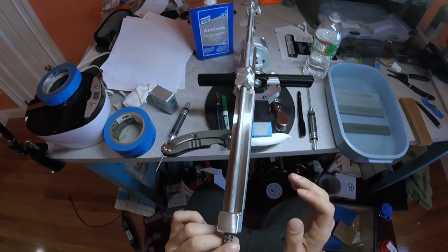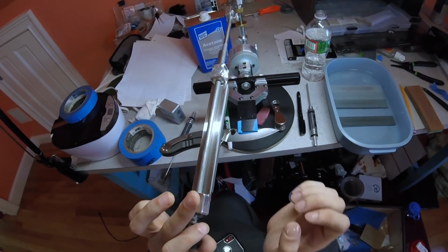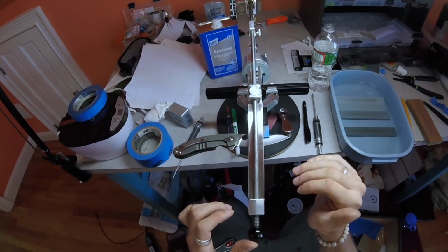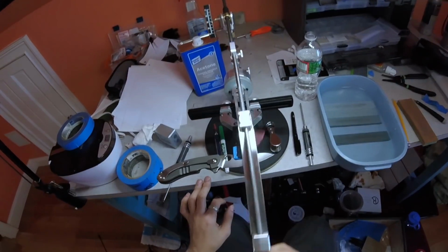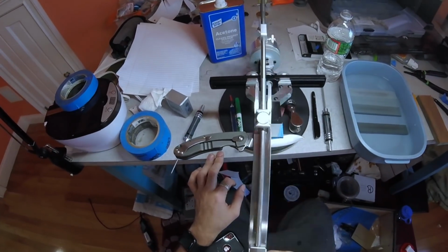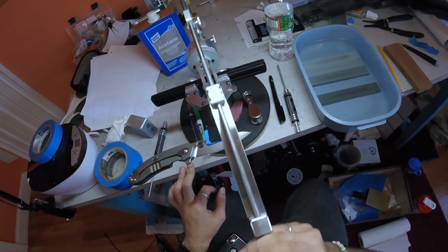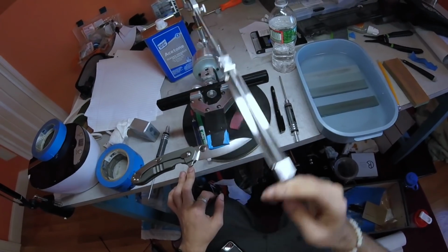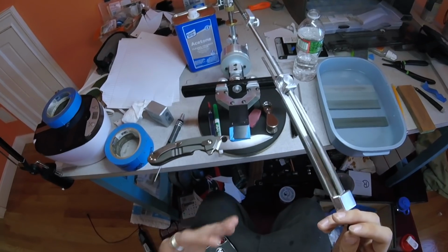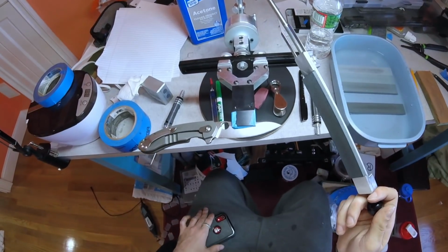What that's going to do is really lower the surface area of your bevel and get through that metal quickly. And then when you go to sharpen, there's such little surface area, you're going to re-apex much faster than if you had just tried to sharpen through it like this. Like if I had a big chip and I just sat there doing this, it would take absolutely forever. You hear what I'm saying? So grind through it, and then reset your bevel. That's going to be your best bet. I promise.